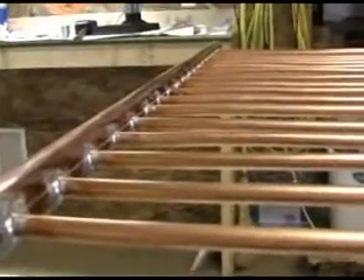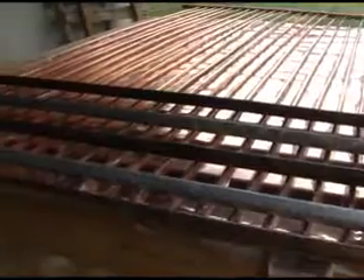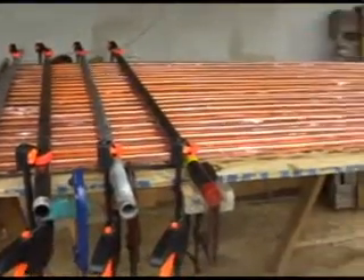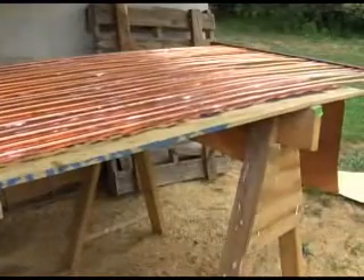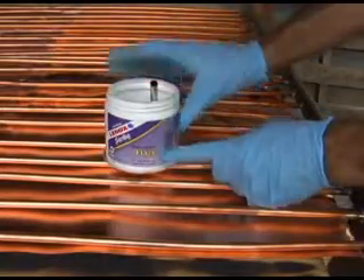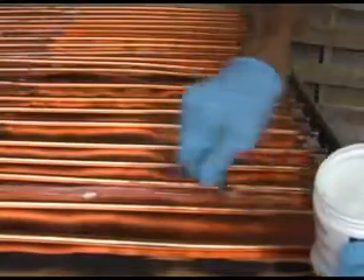Soldering headers indoors is okay, but the next step — soldering five-thousandths inch thick copper sheet to the copper tube — is best done outside due to the amount of smoke you will create. Press the copper sheet securely against the copper pipe. I found three-quarter inch black iron pipe did a reasonable job. Have lots of solder available; I used 50-50 lead-based solder for this part. I also used a water-based flux, which was good for about three solar panels.